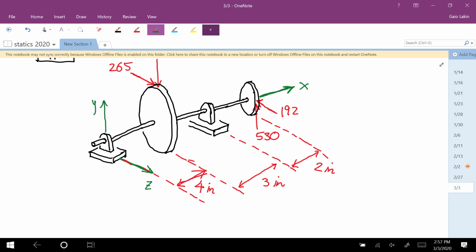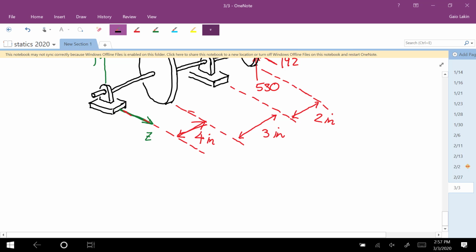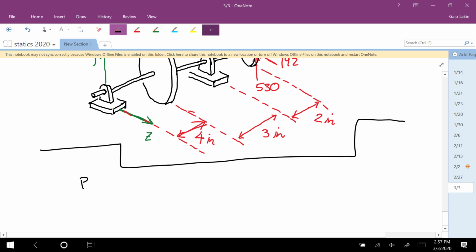And so if you have two of them sharing the same axis, the idea is they don't have to apply those couples that they don't do very well. They each have sort of each other's back. Like if I tried to pull this, instead of this having to apply a couple, it just applies a force this way. That one applies a force that way, and that gives the couple instead of the joint itself doing it. They can apply combinations of forces rather than their own couples. And so in this case, we're going to treat each one like it only applies forces. Okay, so the pin joints are coaxial. So they don't apply couples.